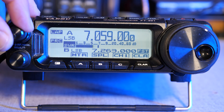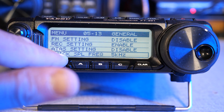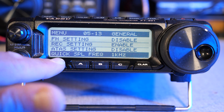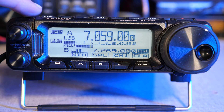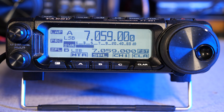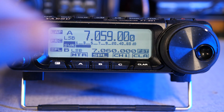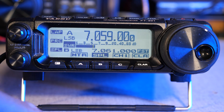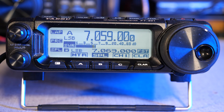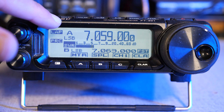If I want to use this on CW, I'll readjust the quick split frequency in menu 5-13 down to 1 kHz. Press and hold A/B to balance both frequencies, turn on split, then press and hold to increment VFOB — now 7059, 7060. Press and hold again for 7061, 7062. It just increments automatically — a really handy feature for quickly turning split operation on and off. To turn off split, now we're back to VFOA exclusively.